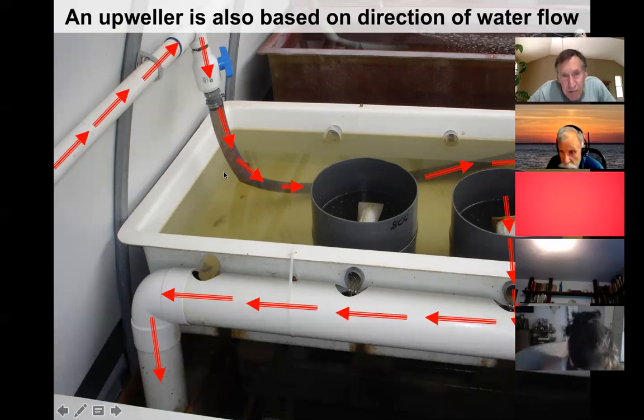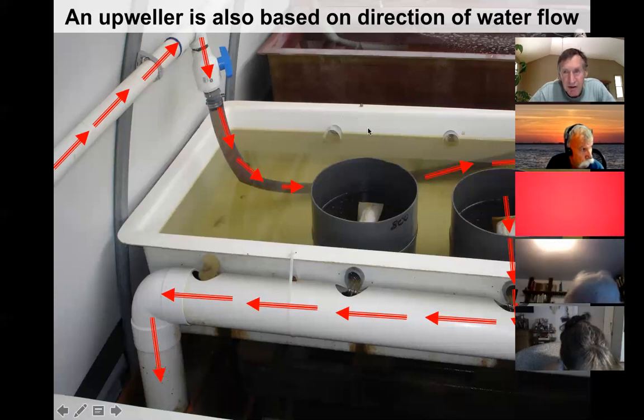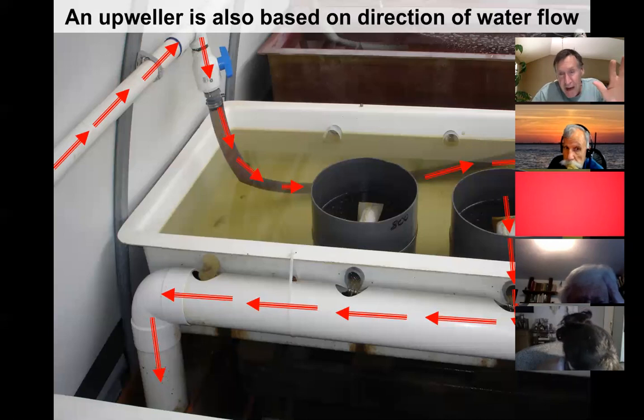So you get the general drift. Now, remember when we said that a downweller, we were going to call it 1 gallon per minute flow. When you go to an upweller, and this is a 2 horsepower pool pump, pumping and filling these tanks, we're now going to call the flow rate 10. We went from 1 gallon per minute flow per silo to 10, an order of magnitude. The water flows quite strong, fills the tank, comes up from the bottom of the screen with the animals in it, out the gutter in a single pass 24/7 at a flow rate of what we're going to call 10